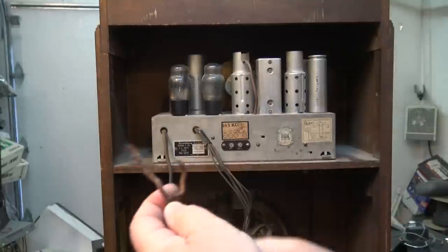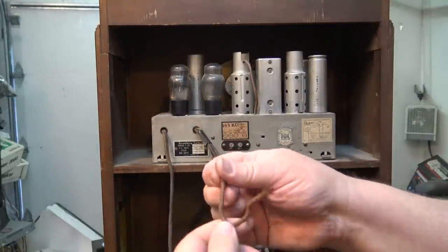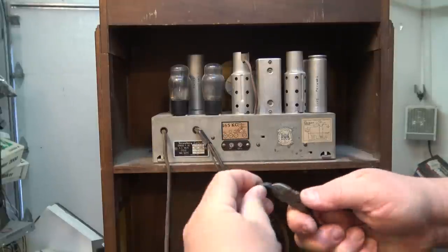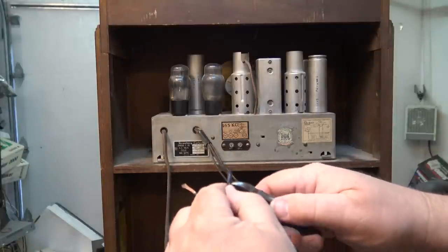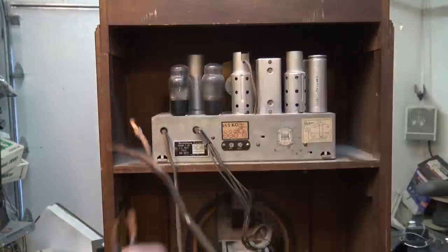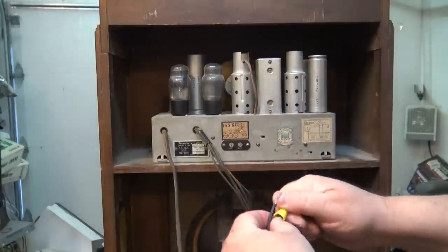This also gives me an opportunity to check out the insulation quality of the old wire — see how bad a shape it's in. As you can see, it's not in bad shape at all; it's actually in very good shape. So what I'm going to do is take my new modern power cord, open up the insulation, take one side, connect it and put a marette on it. The extra wire I'm just going to coil up in the back of the unit.